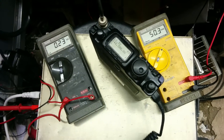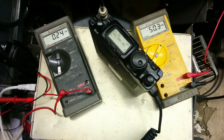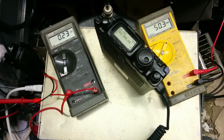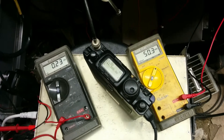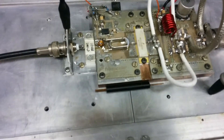Supply voltage on the yellow meter, on the blue, on the black one. It's just the bias current — it's not linear, it's biased for Class C at the minute. 0.2 amps, 50-odd volts, with a very crude bias circuit. You can see the input attenuator in that.